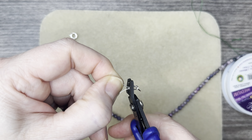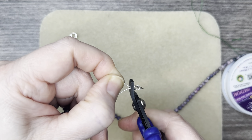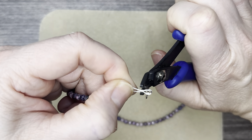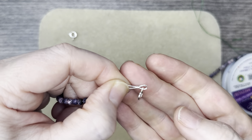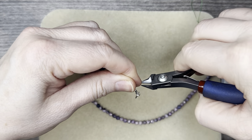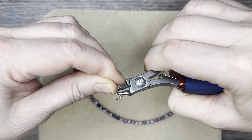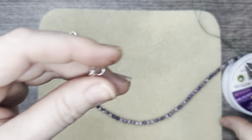With the two wires separated, go into the back notch of your standard crimping tool and give it a little squeeze, then use the front notch and close it off. That first crimp separates the wire into the two different sides. Do a little tug test, then come in with your flush cutters and cut off the end — and there we have it with very little waste.